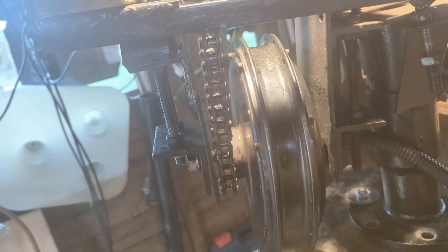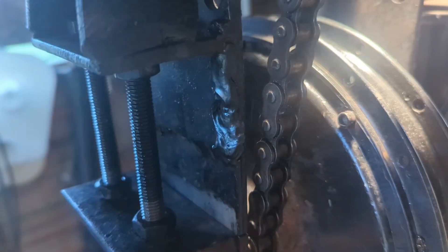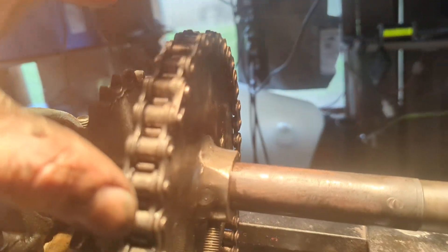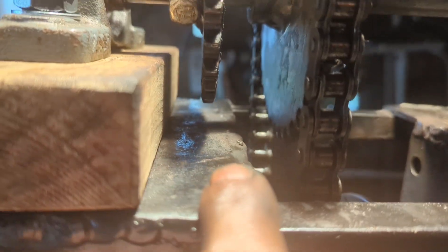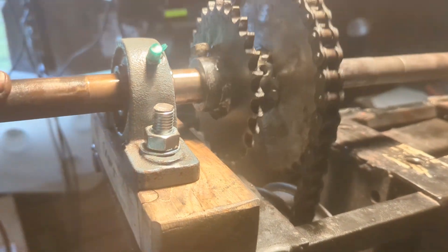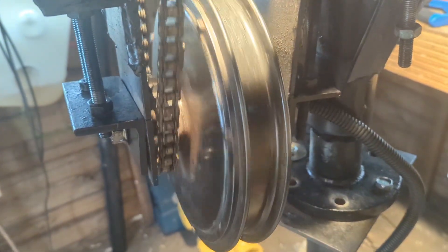So this is how it's ended up for now with the motor in there. It's all about how easily you can turn it by hand — that's quite hard, but it's going to be because the ratio now is 1.85 to 1. We've got a 37-tooth to a 20, or a 28 to a 20. It was a bit of a mission with the chain — we've ended up with one more link than we have to, but I've got it so the chain can be shortened and put on here quite easily, then this will slide into position and this can slide backwards out of the way. You can see we've got clearance on there. That's essentially all of the work done. It's going to be a day or two until we can get it on the tower, and it has to be moved onto the tower in one piece. This will be flying very soon — it will need a good bit of wind to get it going.